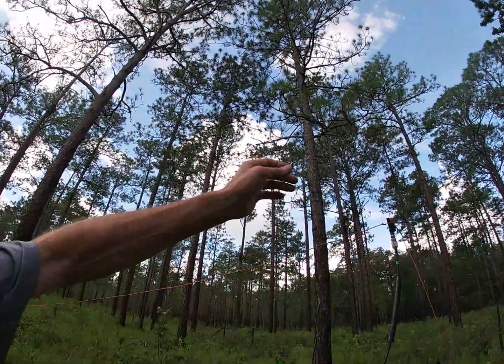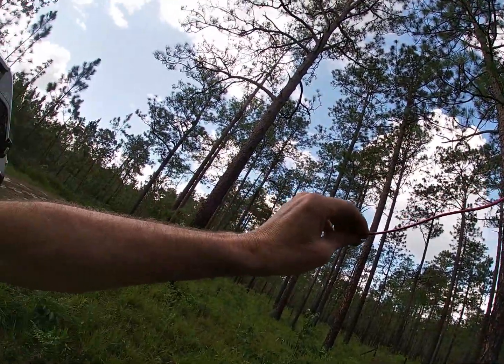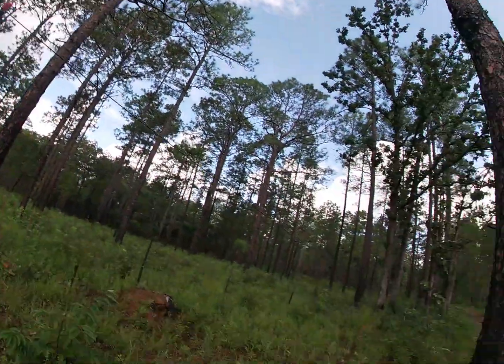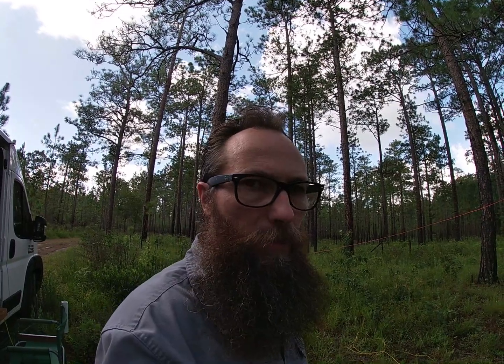This is 26 gauge wire — just leftover stuff nobody was using. This other piece is 14 gauge, a different type of wire. I may build a more permanent, heavier duty version with thicker wire gauge, because when you go to a thicker gauge you're going to expand your bandwidth a little bit. I'll look into the data on that. If nothing else, for durability — you don't have to worry about power handling — but if I can broaden the bandwidth just a little bit to bring some of the other bands into a better SWR, that would be ideal.